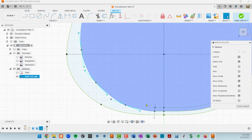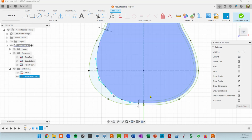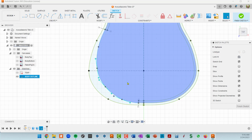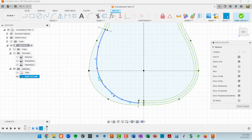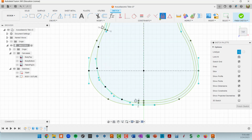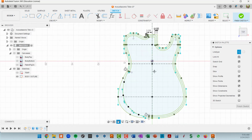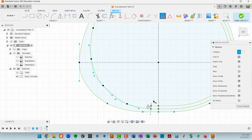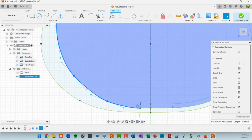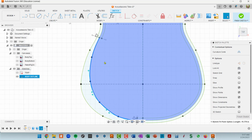And now what we need to do is to make this channel. So we want to go inward from this curve that we just made and link it up to these two curves. And then we'll have our channel done. Okay. So I think I'm going to go ahead and fix this also. So now all of these curves are fixed. And what we're going to do is to try the offset tool and offset this curve by the distance of that ledge, the ledge width.